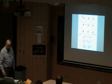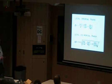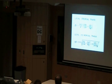All right, now you put these together the same way you would for an eye lens, for a spectacle lens. These came out of an old patent by a guy named Quinault back in 1959. The local spherical power, in this case error, you get by combining those terms, and the local cylindrical power you get by combining these. So you can apply a tolerance by saying, we're going to keep polishing this baby until we get down to better than 1/8 of a diopter of astigmatism everywhere and 1/4 diopter of sphere. Right? Real simple, real straightforward.